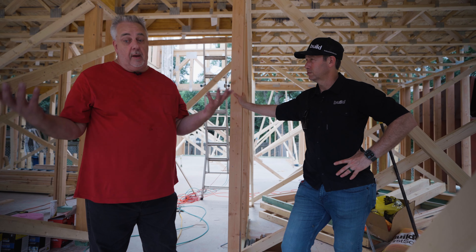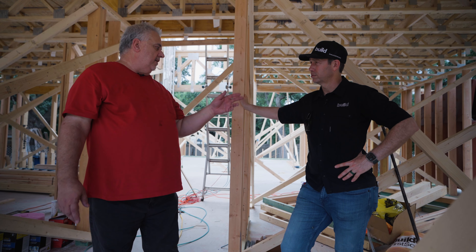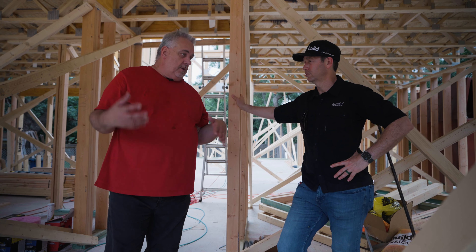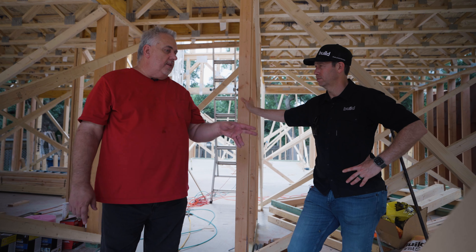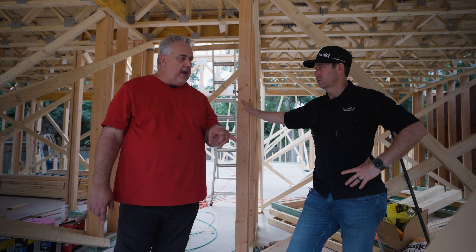They should be rolling trusses on day six or seven. The house is approximately 3,100 conditioned square feet plus garage and porch — probably around 3,700–3,800 square feet of framed area. Compared to standard stick-built framing, this is certainly faster. Pre-planning in parallel with systems is the key advantage — the linear part is what kills you. Pre-planning with the architect, mechanical designer, and others absolutely pays for itself in construction. The beauty of ReadyFrame is that layout is already done, so you can put multiple teams on different walls simultaneously.